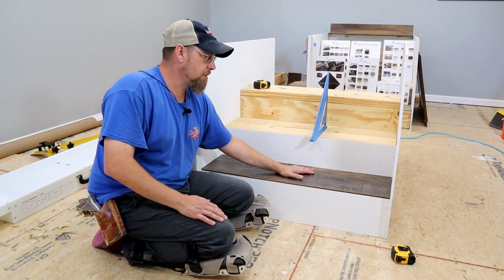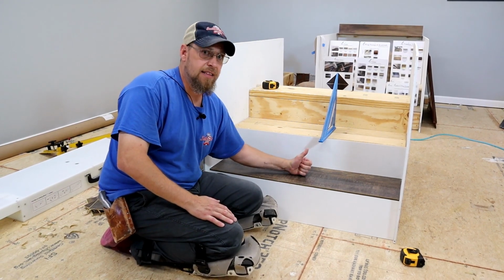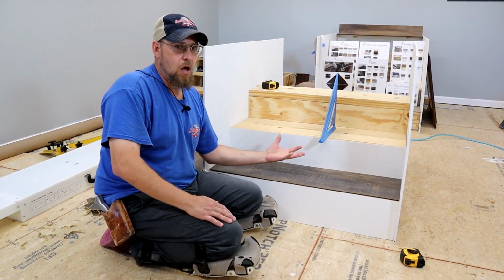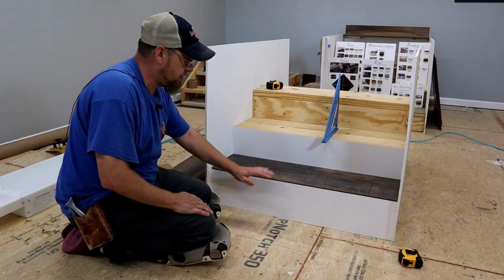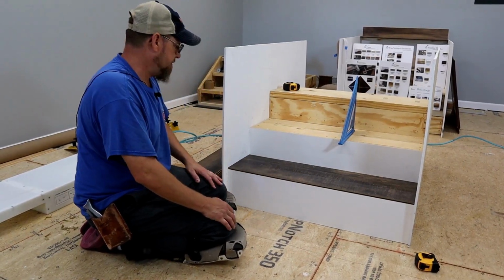So when you put your polyurethane wood adhesive on the step, you won't hear any kind of hollow sound. It's going to feel and perform like a solid chunk of wood, which is exactly what you want. Once again, I will leave links in the description to all the adhesives I recommend for these vinyl planks and risers.